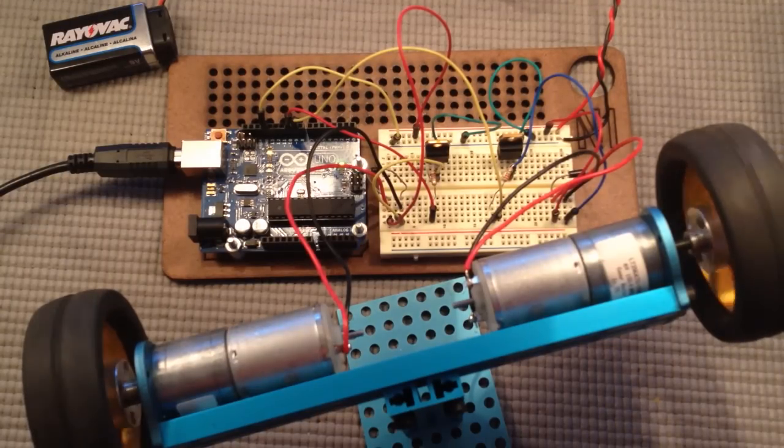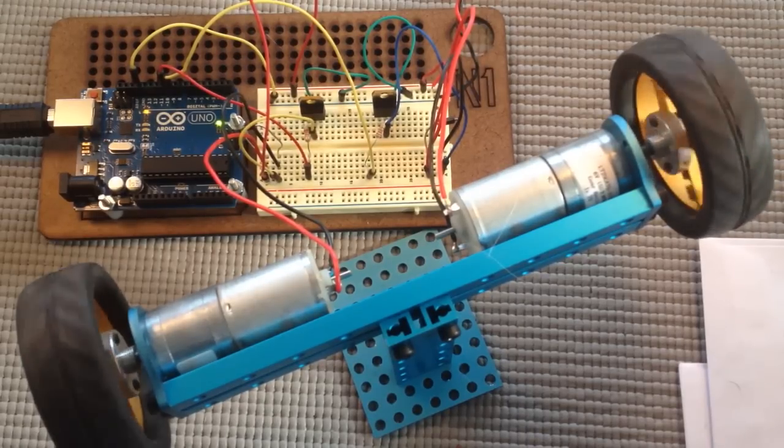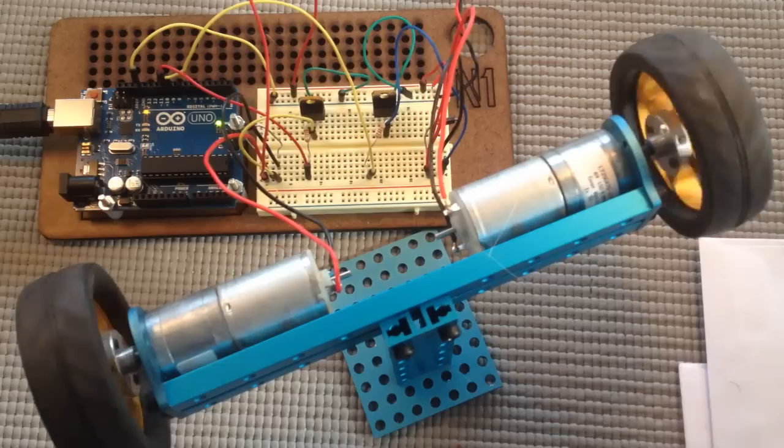You could easily swap in a 24-volt power supply and get much better results. That is how you control motors with an Arduino. One thing you probably noticed is that there's no reverse — it's actually kind of tricky to do reverse with an Arduino, because you would have to have the ability to reverse the polarity on the motors. In the next lesson, lesson five, we're going to look at an Adafruit motor shield — a PCB that fits on top of your Arduino and gives it a lot of really cool capabilities for controlling not only DC motors but also steppers and servos. See you then, thanks for watching.